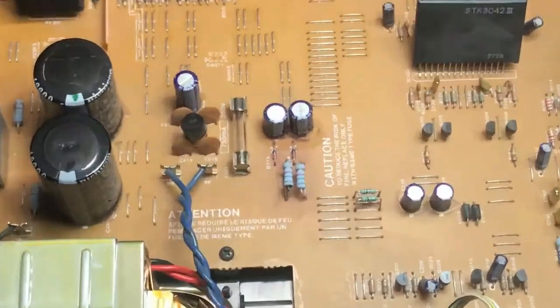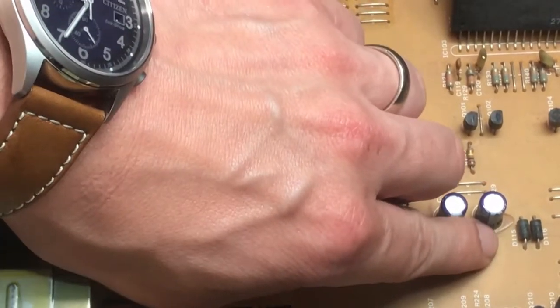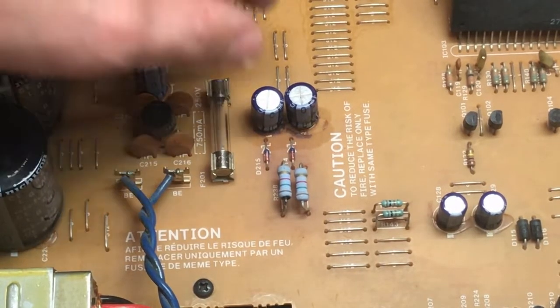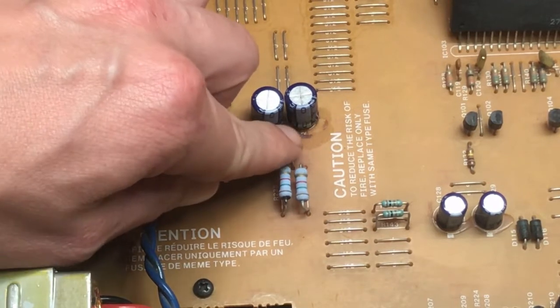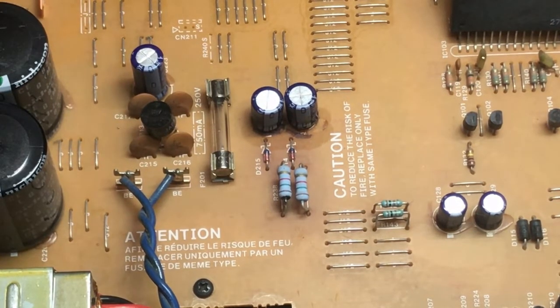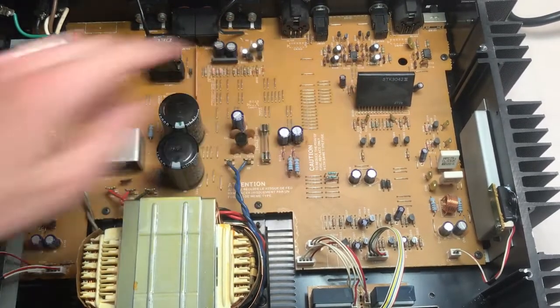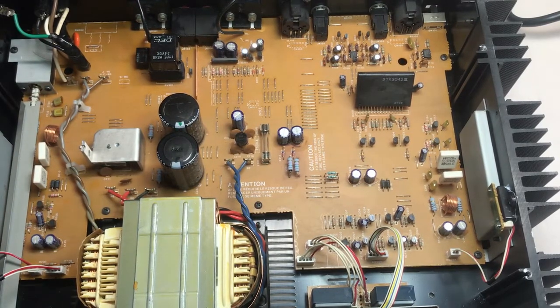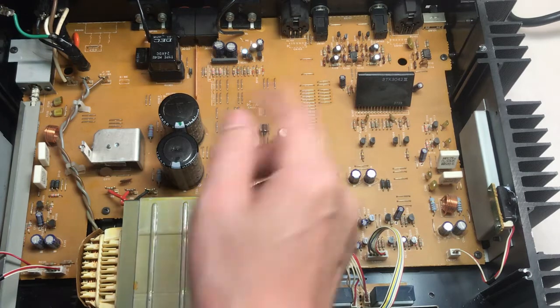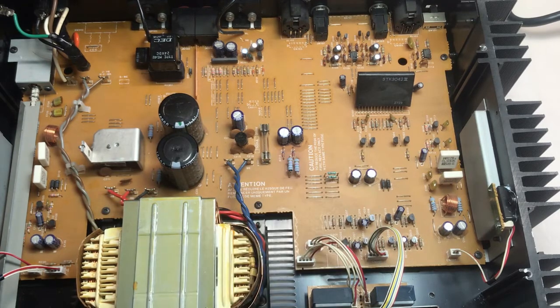The second item of concern - maybe you've already seen it - these two capacitors. I know there's glue around all of these, but you can also see brownish discoloration around those capacitors, so I'm guessing one or both has leaked out. Number one for me, and it's not obvious because there's nothing visible about it, is this dual channel integrated audio amplifier. I spotted it before I even opened the cover through the vent holes, and it looks identical to an integrated amplifier I had to replace on an old Sony receiver - those don't make these anymore and it was a pain to find one on eBay.